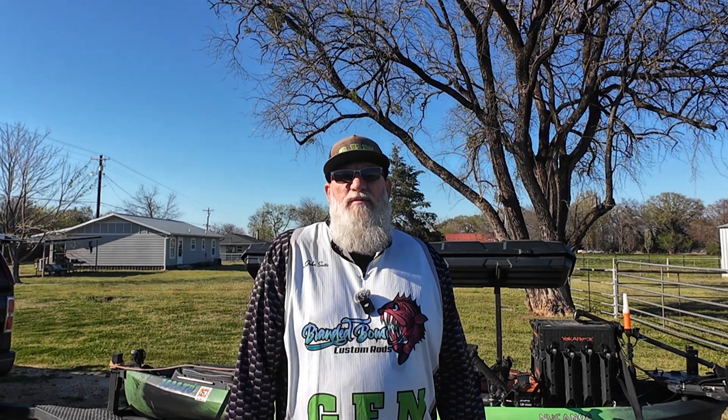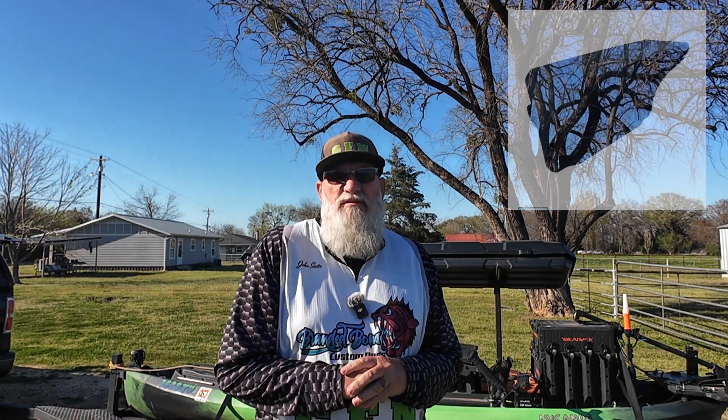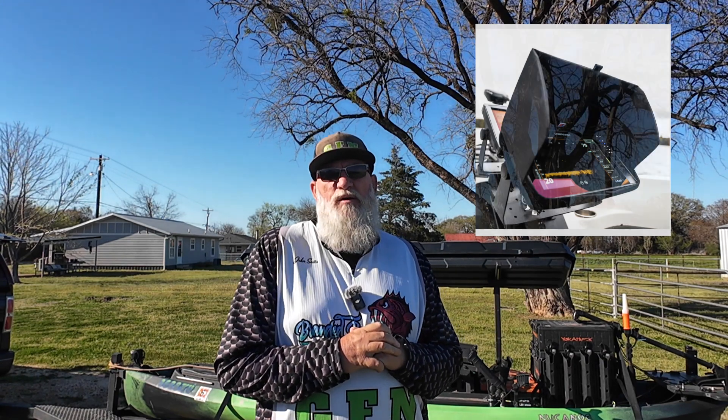I hope this helps you guys. Sun covers are available for this unit — you have the Berkley Pro, but it does require some adjustments for the rear mounting screws. Solar Shield also makes a great Eagle Eye 9-specific sun cover as well as a transducer cover. Rip-a-Lip makes a great generic soft shade for this unit as well, or you can reach out to a local 3D printer guy to print one. Screen protectors made from computer products off Amazon are cut to fit and work really well to combat glare. This unit uses 2.9 amp hours of power — I'm using a 100-amp dedicated lithium battery and I'm getting easily 30-plus hours on the unit.